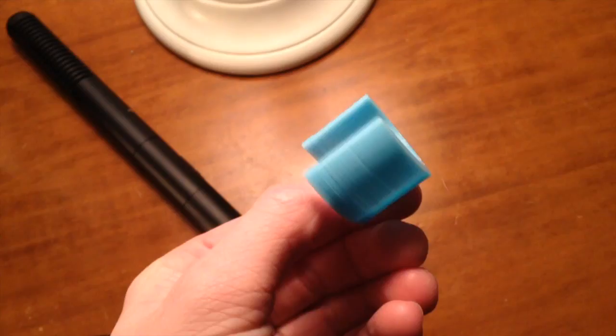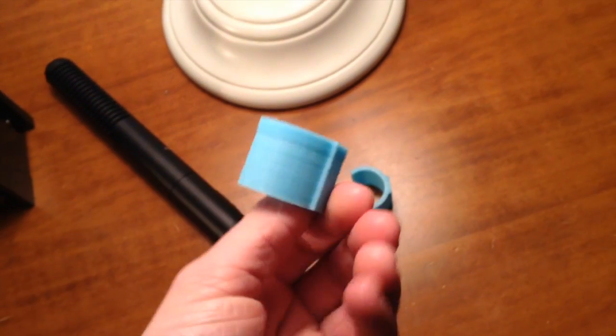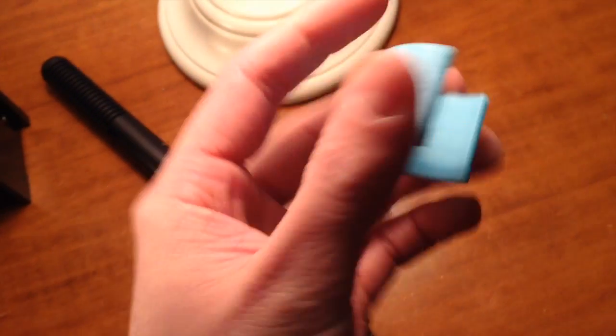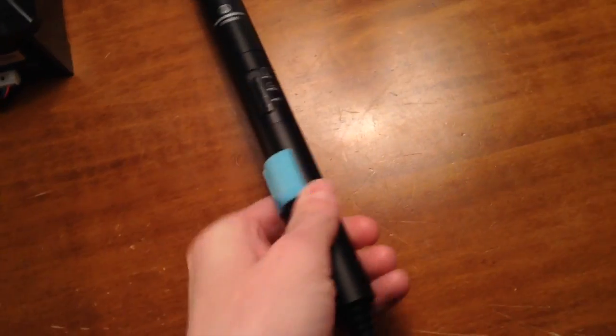Next day - I adjusted the file some, increased the thickness of the walls, and printed both pieces. Both pieces were too thin before. I printed these way too fast and there's over-extrusion, and it was a little too hot too. So this is not a very good quality print, but it is a very strong print. This one is actually for the tripod - this is the one that clips right on.